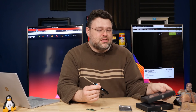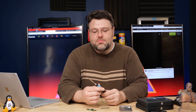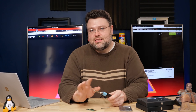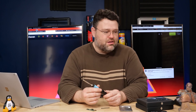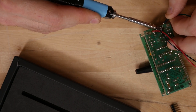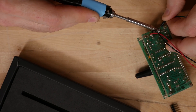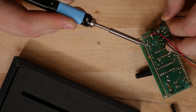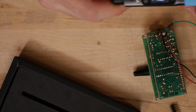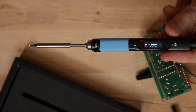I'm usually doing a lot of really super tiny soldering, so one of the kits has mostly really tiny soldering tips. Because it's got the sensor in here, it's adjustable, and you can reprogram the calibration, this makes it a really delightful soldering experience. I did a little bit of soldering on my frequency counter — a 7780-based frequency counter, nothing special, useful for looking at what speed a pin is flapping. It was all hand-soldered and it was a joy. I've done a couple of projects with it now and I've been very, very satisfied.